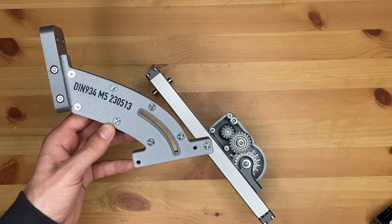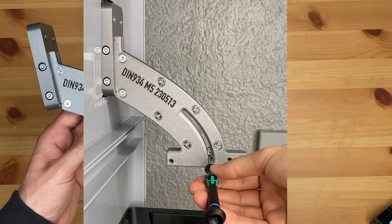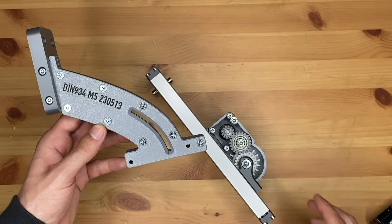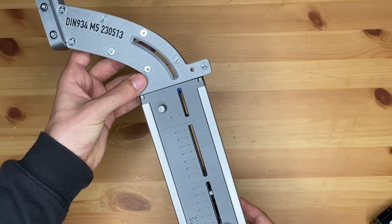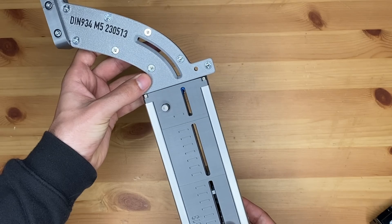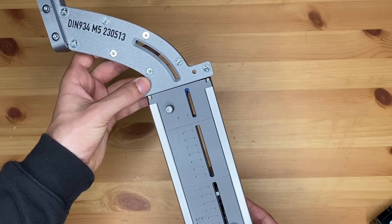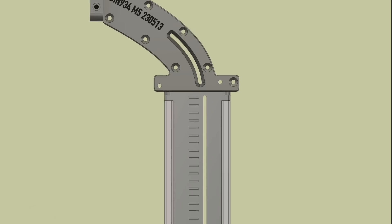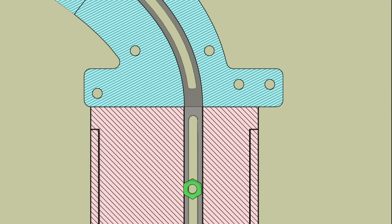This is the component that redirects the nuts from the feeder unit. The magazine gets connected to this segment. When both segments are perfectly aligned the nuts just slide through, but if there is an edge they will get stuck. So far this is pretty intuitive — what is not so intuitive is how sensitive this is, in other words how perfect this transition has to be to avoid a problem.